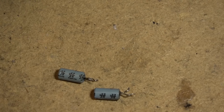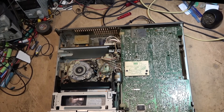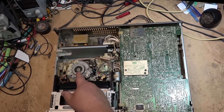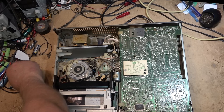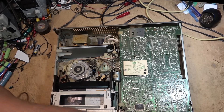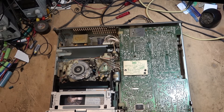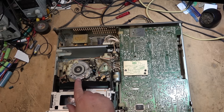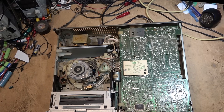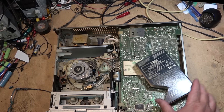Okay, all done. I'm not saying I wouldn't have found this without putting a fluorescent light on it and watching for the drum going out of sync. But initially I was thinking it was a capstan servo problem, when in fact it turned out to be a drum servo problem. By using the stroboscopic effect of a magnetic ballast fluorescent lamp, I was able to see that drum going out of sync.